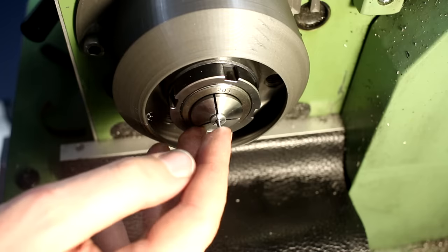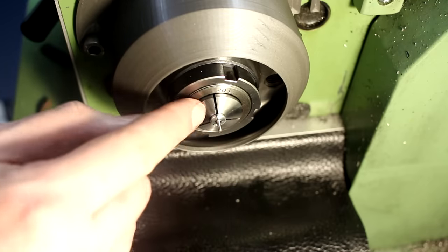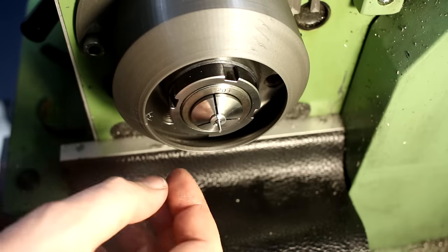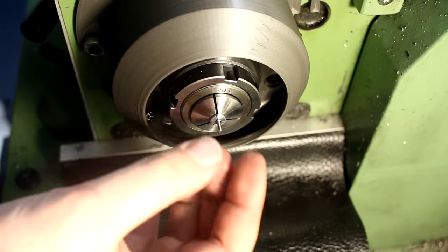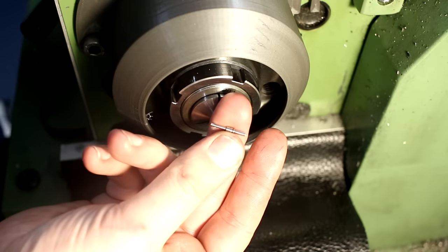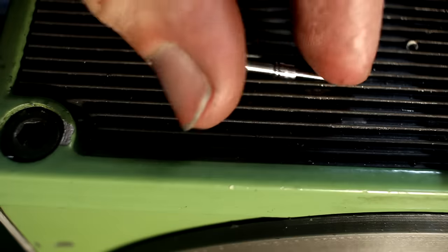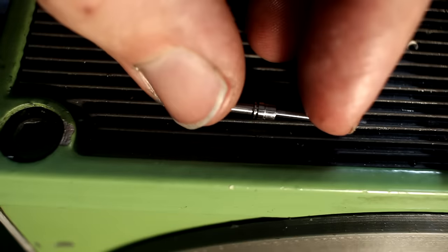I was able to drill the end with a 70 micron drill and turn down the OD, polish, deburr, done. Not much to do on the second side of these parts. That's the result. I will show a close-up after this. Here is one of the scrap parts I made.